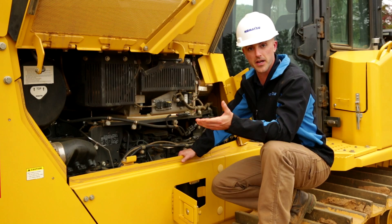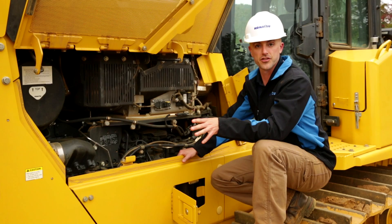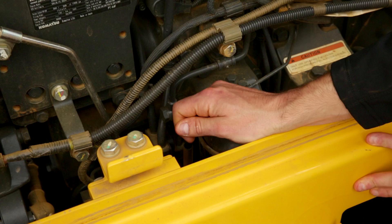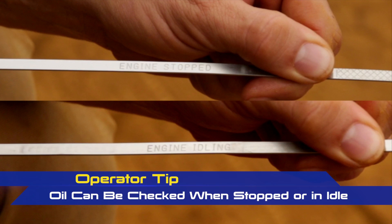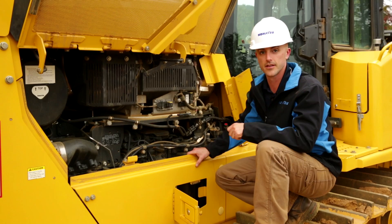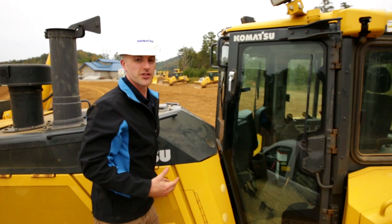Now that we've accessed the left side of the machine, once we get the doors open, we can continue with our visual inspection of the engine compartment. Like we did on the other side, we're looking to make sure that the connections are okay, there are no leaks, and there's no debris. From here, we can move to our air filter and take a look at our latches to make sure they're in place. You also have the location of your air restriction gauge. From here, we can move to the engine oil check spot and our dampener fluid check spot. The last thing we'll do before we close the doors is take a quick look at our fuel pre-filter and make sure there's no contamination.